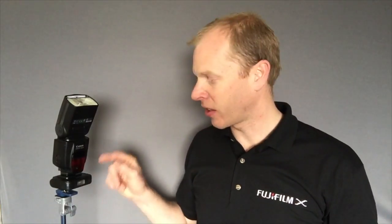It's literally as easy as that. Now this isn't a TTL system, so if you are using it on any camera, you have to control the flashes manually. What it does do is it uses the TTL controls in the flash to control the power wirelessly. So I can change the power of a Canon or Nikon speedlight from the camera using this unit, but it's not a TTL system — effectively using the flashes in manual, which is how I use flashes anyway.